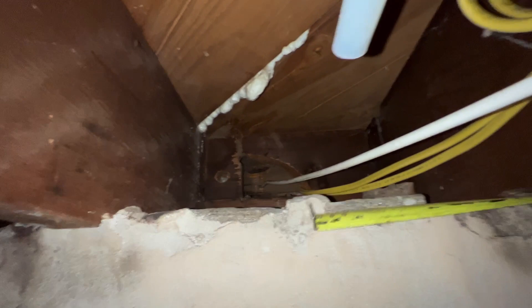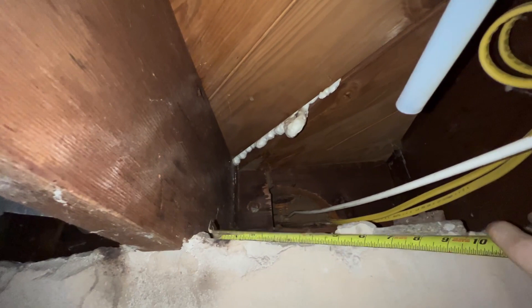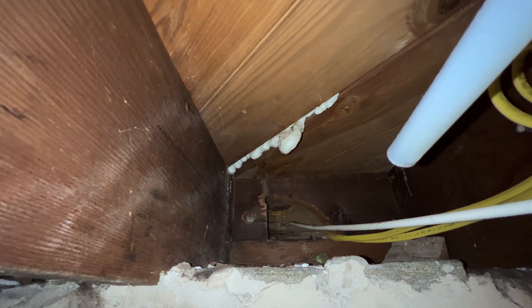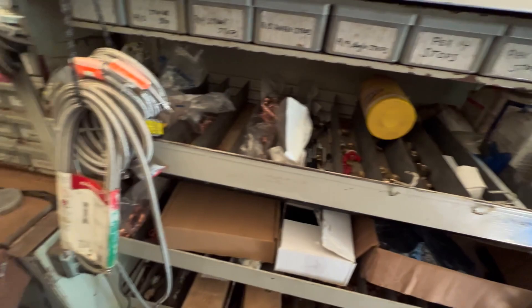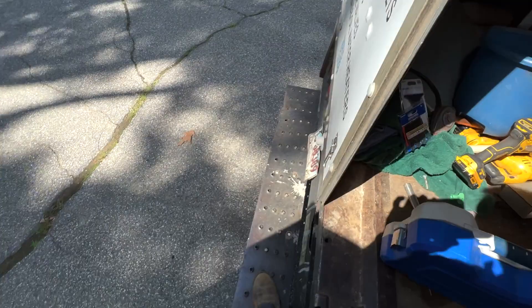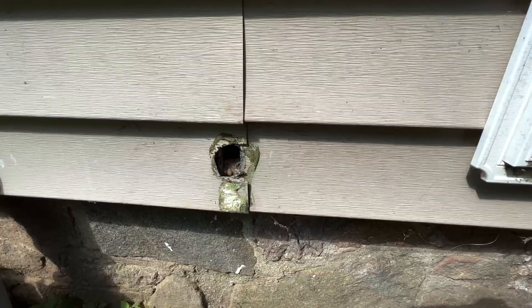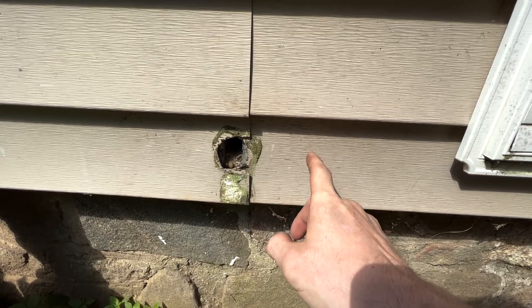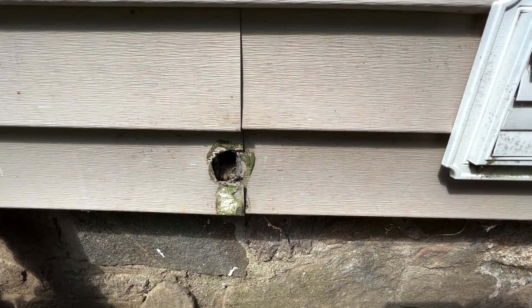Five inches — confirmed. I might actually go this way with it; there are fewer wires to contend with over here but we should clear it. Let's go back up. We'll put the laser level off to the side, grab the hole saw socket and the drill, open that hole up and drill the other one. We want to go five inches over from here — we actually have more room this way anyway. We'll shift the cold that was here over and run the new hot to it.